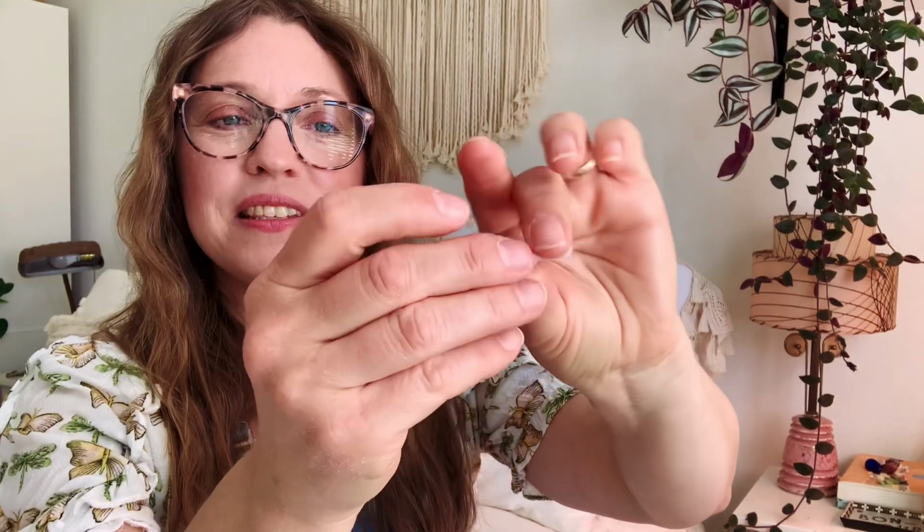All right, so what you need is a wall anchor. Basically, you drill your hole in the wall, and then you put this wall anchor in there and push it all the way flush against the wall. Then you put your screw in this wall anchor, and this secures it. It opens up when the screw goes in, grabs onto the drywall, and it's going to hold securely.